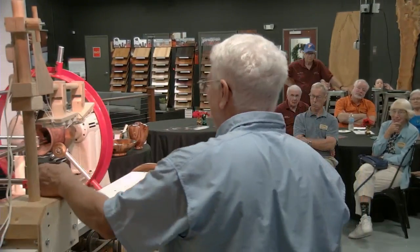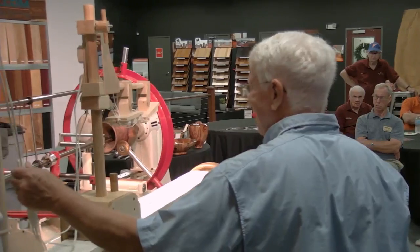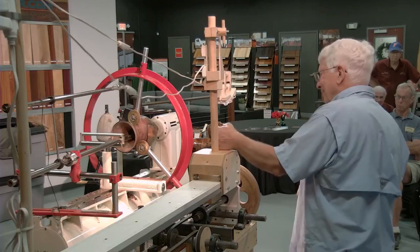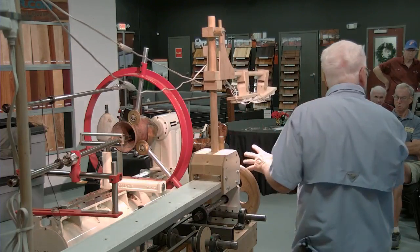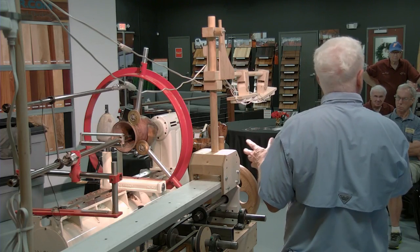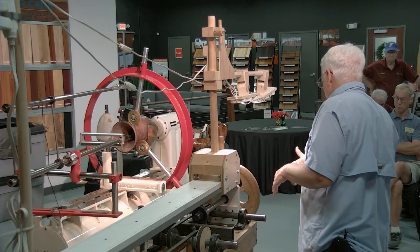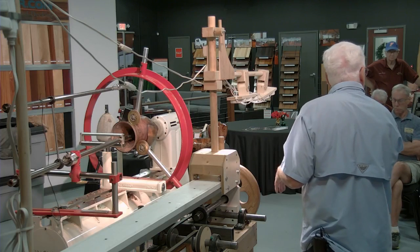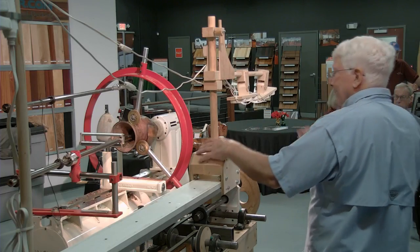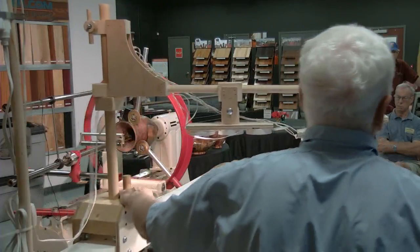This is one of my great additions. The one thing as I'm putting this on is you've got to see the reflection. So I made this — as I'm putting the epoxy on over here, you've got to see it. With the reflections, as it's rotating around, if you've got a void or a holiday — if you've missed a spot — you need to see it, and this really helps me. Generally if I'm doing a big hollow form, I've got another little LED light mounted over here that's shining in it so I can get a handle on what I've done there. As I'm getting done and inspecting the rest of them, I can roll it along.